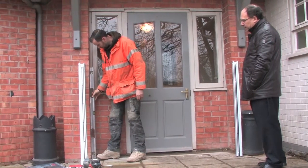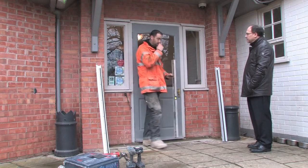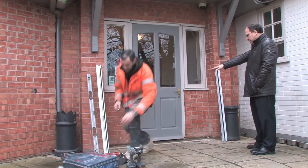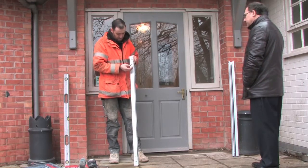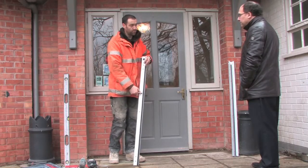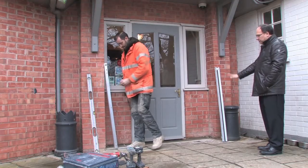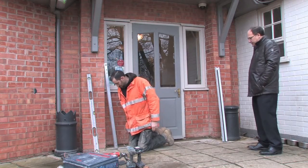This was previously checked when we came to measure, so we'd account for it if we needed to pack and so forth — in case the walls weren't quite square through the floor. We've dug all this out and set the concrete lintel on mortar — extra strength — so we know it's going to go off quite quickly and it's really strong. We know it's where it needs to be. You do that the day before to give 24 hours to set.